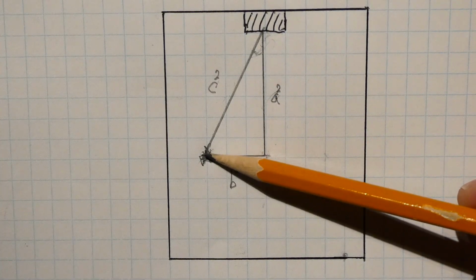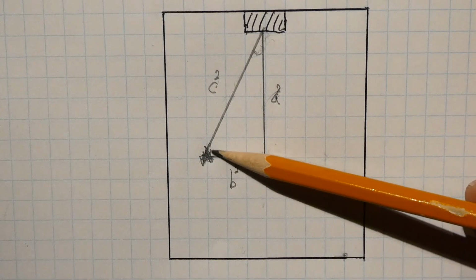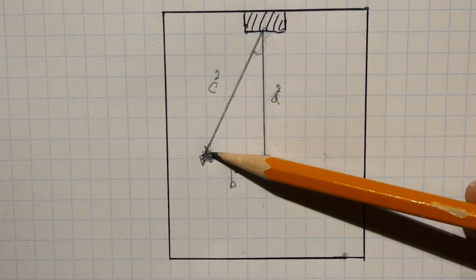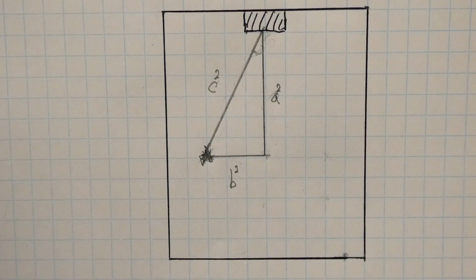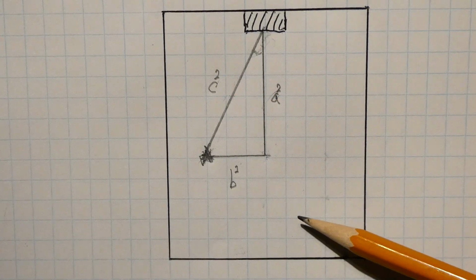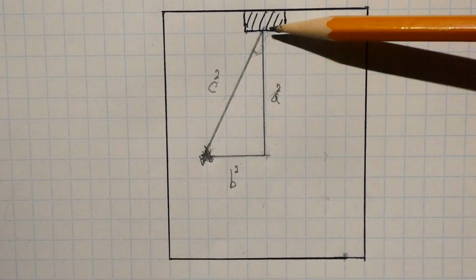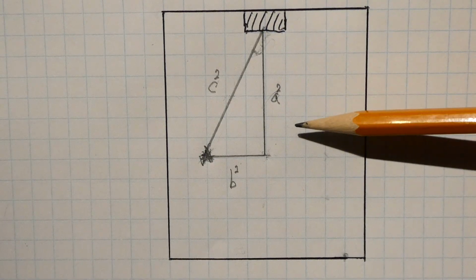Now if this person is moving towards the sensor or away from the sensor, it will detect which direction he's going and the speed. So this sensor is a tracking sensor. It's a human tracking sensor. So as a person moves around the room, we could always track it. We could get a reading, angle from the center line, and a distance and the speed.